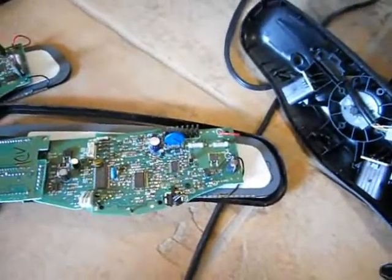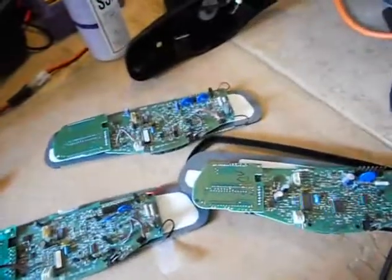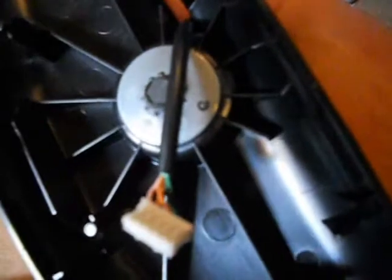You verified that's working correctly. Set them all — no one will ever know where they've been messed with. That's my restoring, my resto deal, because the little screw holes always get loose. When these mirrors are in a car and they start rocking back and forth, that little bolt right there loosens up. So you just take them apart and crank down that bolt. You should really use Loctite, but I haven't been. It'll fix it up. I originally had to do that when I put that first mirror in my truck — it was rocking. I fixed it.